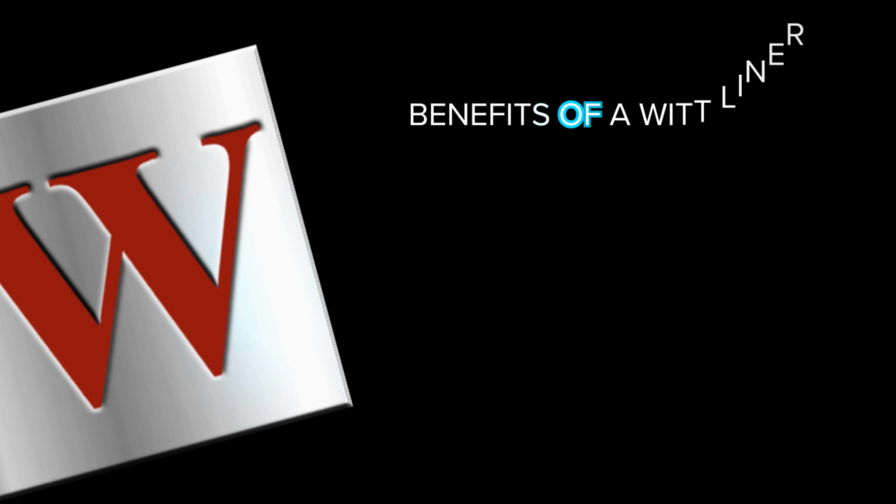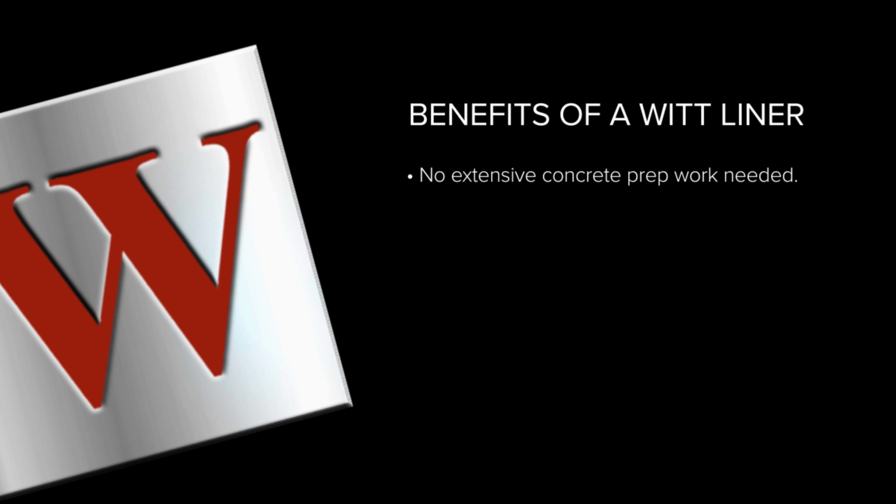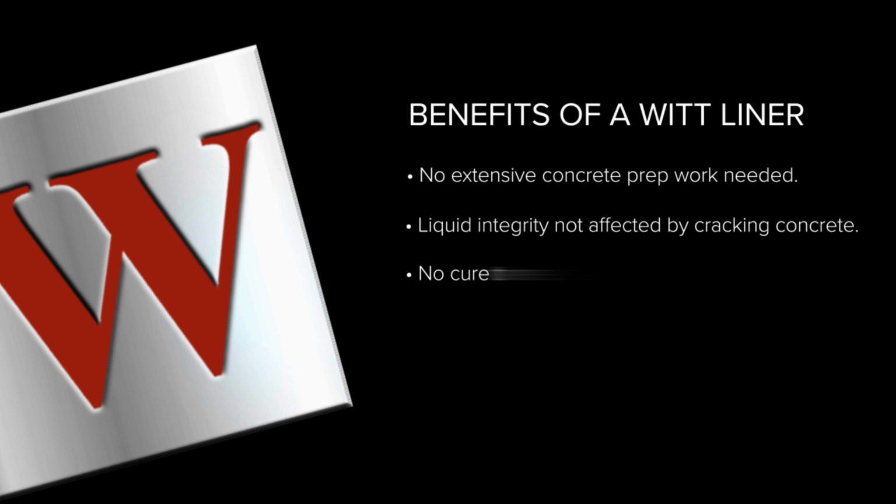The flexible liner from Witt Lining Systems offers many benefits in a concrete application. Among them, there's no extensive concrete prep work needed prior to installation. Once installed, the liquid integrity of the liner is not affected by cracking in the concrete that will occur. No cure time is needed before the liner is put into service. If ever damaged, a flexible liner is easily repairable, and unlike an applied coating, a flexible liner doesn't flake, peel, or chip.